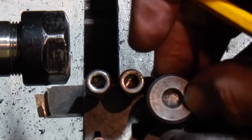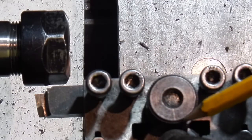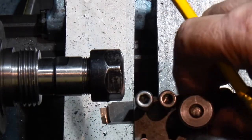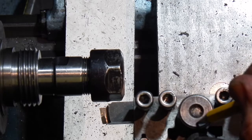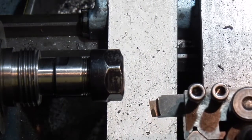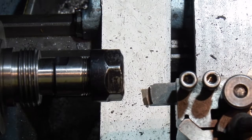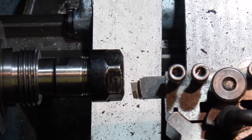So when I do the one side, say to 6 o'clock there, I will then turn it round, back the tool off, and then come back down to the same position so that each side is equal. And you control the depth, the length in, you can just turn the handle, or you can set a dial indicator on your carriage, depends how important the depth is or the length, to move up to the same stop.